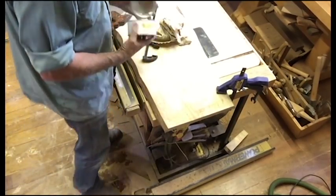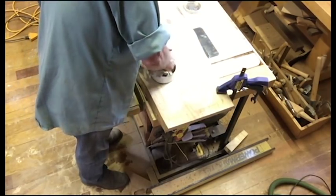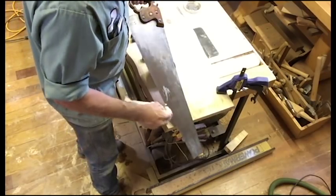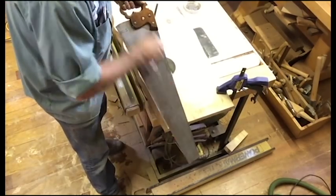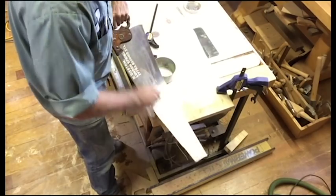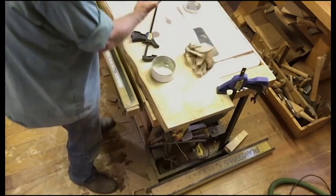Here's a final tip. If you have your saw sharp and clean — no rust — wax up that saw. Wax it real good with a good paste wax and it does two things: it protects it from rust, but it also makes cutting just glide through. It is so much easier if you put a little bit of wax on your saw. Try it. So if you've got an old handsaw, tune it up, sharpen it, and get used to using your handsaw.